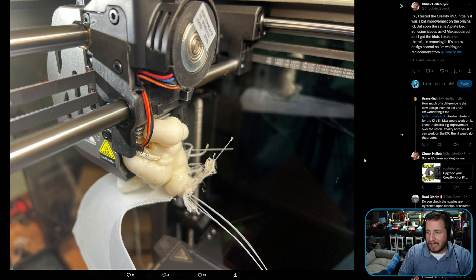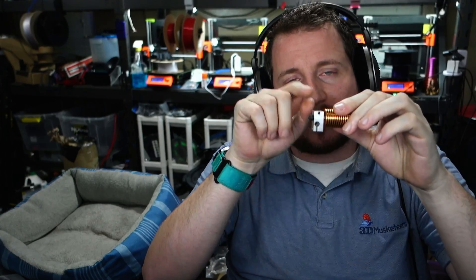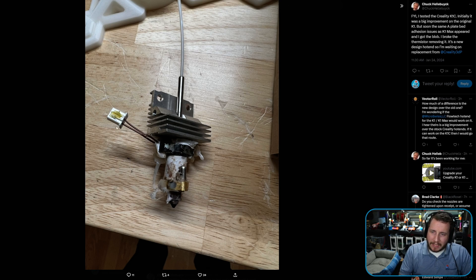Those types of blobs of doom are bad — proper bad. When it fully encompasses the hot end, you're going to end up replacing parts. Now that we're moving toward ceramic heaters for hot ends, it's way more complicated. You can't just pull out a heater cartridge and put in a new one. The old cartridge thermistors and heaters were easily replaceable, but they don't provide as good or as consistent heat as these wrap-around ceramic-style heaters. These new ones are often PTC as well, so they're considerably safer, but it means thermistors are likely relatively proprietary.